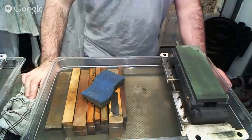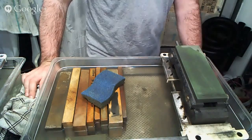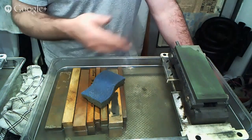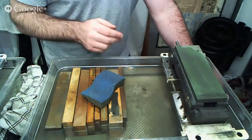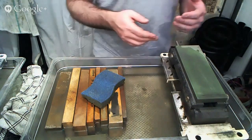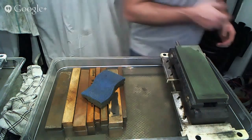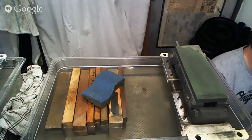Now, how thick or thin the knives are behind the edge will, of course, be a function of what the maker wanted to do, and how thick or thin you can go will be a function of the steel and heat treatment, along with your skill and technique in using the knife, obviously your ability to sharpen it, and personal preference. So some people might like thinner knives that move through stuff a little bit more easily but require a little bit more care and finesse in use, as they might chip a little bit easier and not hold their edge quite as long, whereas other people might like something that's tougher and more durable and they can beat the crap out of it and not have to worry about. So, you know, there's a lot of personal preference involved there, but obviously softer steels will not be able to hold as acute of an angle as effectively as harder steels, and also the harder steels are going to be more brittle regardless of which way you go, but obviously a lot more brittle as you go into the world of thinner thinness.